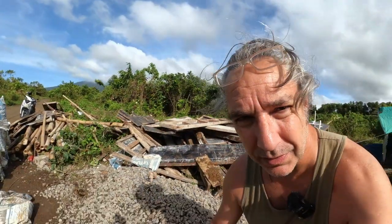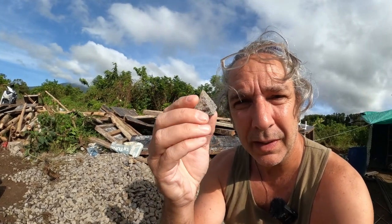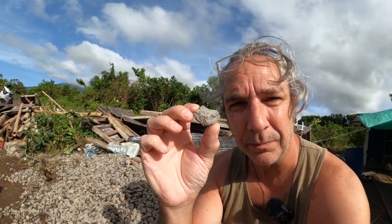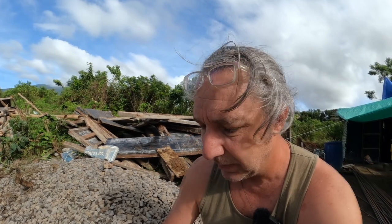We changed to this really nice 1-inch clean gravel that is really good for flooring. It's clean, there's no sand in it, so it'll drain well. It costs a little more, but I think it's worth it. So we're using this for the bottom of the box culvert, but more importantly, this is going to be 4 inches laid under the 5 inches of concrete in the garage floor.